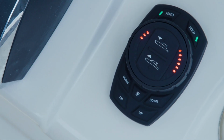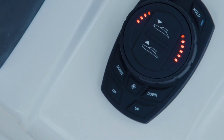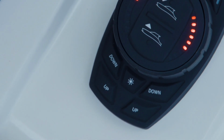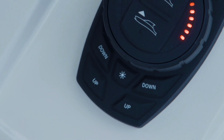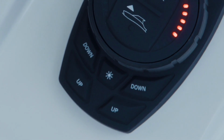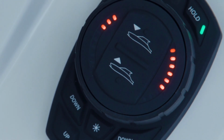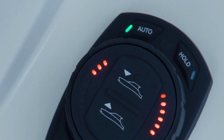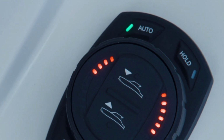Upon initial power-up, the Pro Control Auto keypad will enter the first of its commissioning menus. This menu can be entered or re-entered at any time by pressing and holding all 4 lower up and down buttons for 3 seconds. While the system is in the commissioning menu, the green LEDs next to the auto and hold buttons will be alternately flashing.